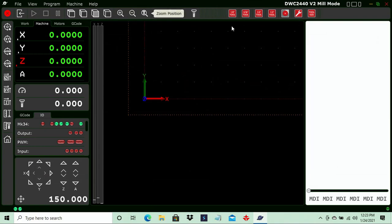Now let's look at the other function tools. The buttons for eighth inch tool, three sixteenths, quarter, or half — if you're using a straight tool with that diameter, you can use one of those functions. Let's change over to the 60 degree quarter inch V bit and run one of those operations.